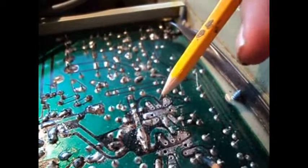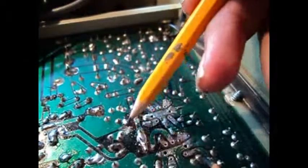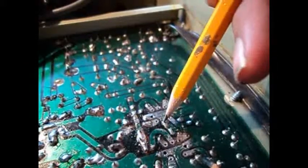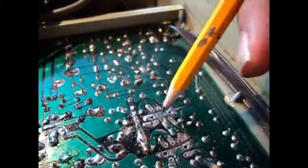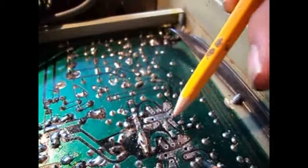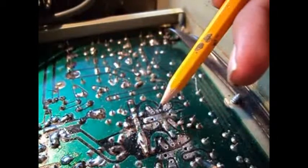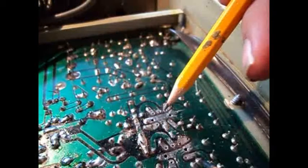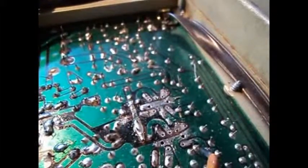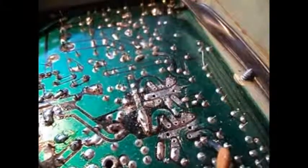And so what I did to figure that out was I isolated this pin here by cutting the trace, and I still kept getting continuity between primary and secondary of these two guys. Then I isolated the pin of the transistor, and I was still getting continuity between all of these sides here. It wasn't until I took out the transformer that I stopped reading that weird continuity between those two sides of the transformers. So let me show you what happened here next.